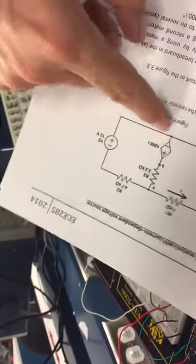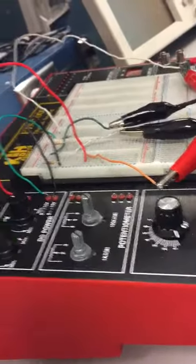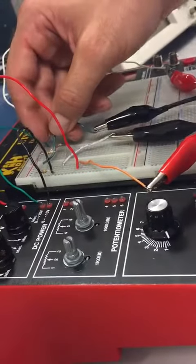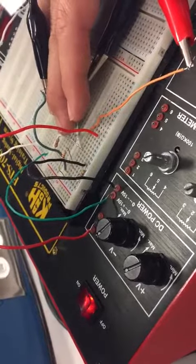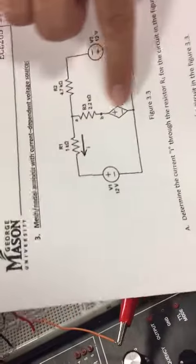So basically we want negative. Let's see where it goes — we can just look. Here's the ground; that's all going to the ground. You can see this red wire going to ground. This here — positive, or in this case negative — that is the other terminal of the voltage, and that is going up by the 4.7k ohm resistor. That's a 2.2, and that's our variable — right next to the 2.2, which is the red. Exactly where it should be. The negative part is right by that 2.2, and that's all that's going on.